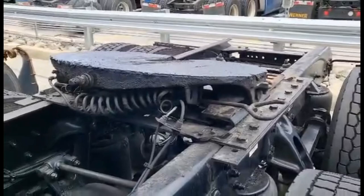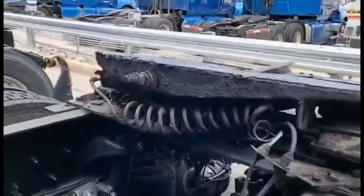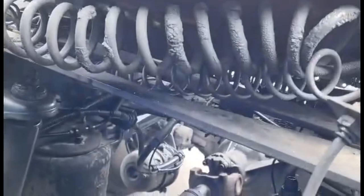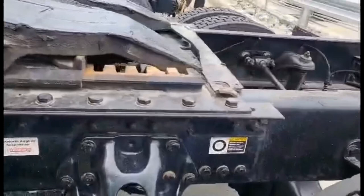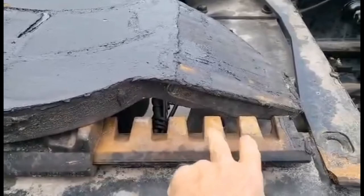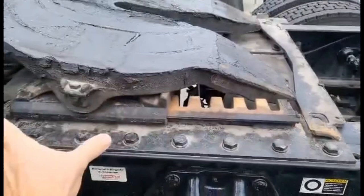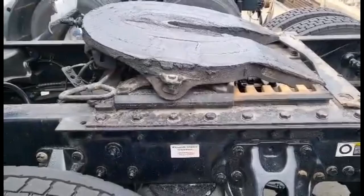The other skinny little hose goes to another air cylinder that unlocks the lugs on the fifth wheel so it can slide. You see these grooves here — inside there are little prongs that stick out and lock into these positions. I can change the position, sliding that whole assembly back and forth on this rack, so that the front end of the trailer is a little bit back or a little bit forward on the frame of the truck. And that's another story we'll get to.